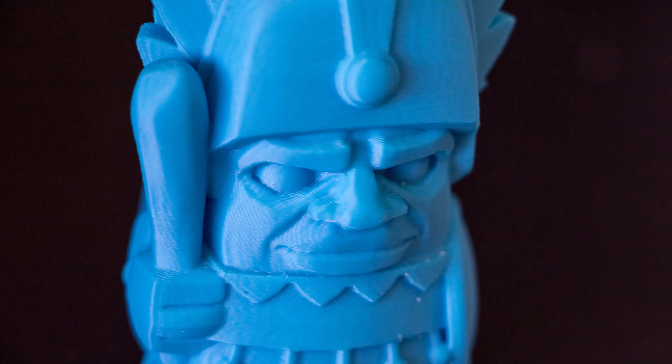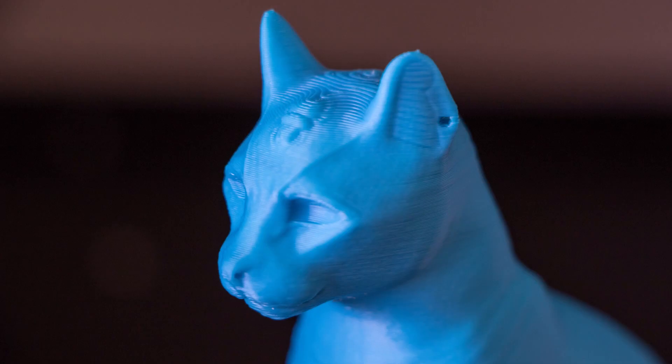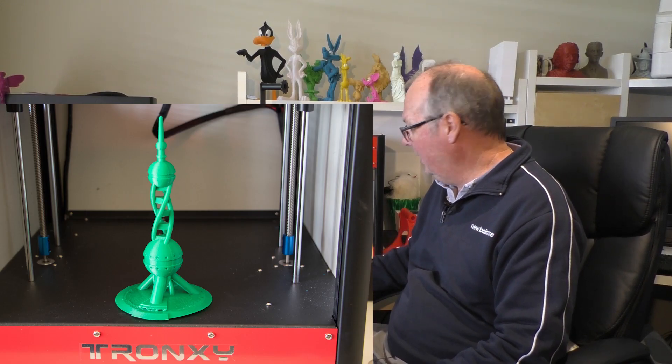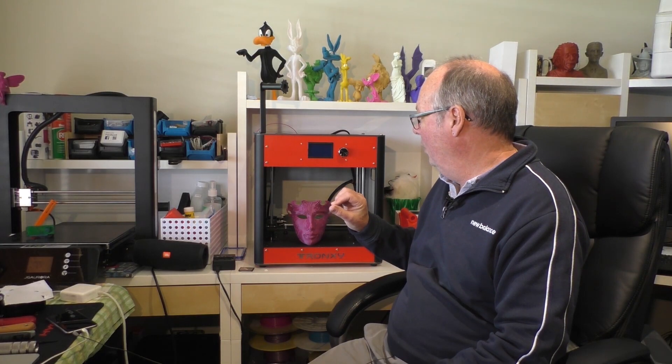Because it's self-contained, because it's in a box, you can print ABS straight out of the box — that's right, ABS straight away. I love my ABS and this printer as it sits right here will print ABS beautifully. You'll see by the pictures rolling through that the smaller models in ABS are close to perfect — no layer adhesion problems, everything worked beautifully. When the model is a little bit bigger, I did have some minor layer separations because it's a larger model with sharper angles.